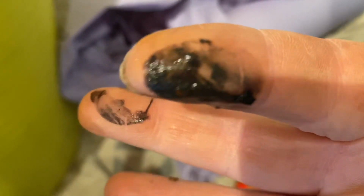Just see, it's the top one. It's all sludged up. If you can see that other side as well. Again, you can see it's all sludged up. So it's blocked up because the system's sludged up, or there's muck in the system, and that's why the plates are blocked up, rubber hoses, etc. So as I say, I'm going to clean this plate out now.